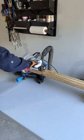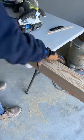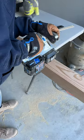I cut my 2x4s into 65-inch and 17-inch pieces, and I cut my 4x4s into 26-inch pieces. If you don't have a big enough miter saw to cut the 4x4s, you can use a circular saw and score it on all sides until it cuts through.